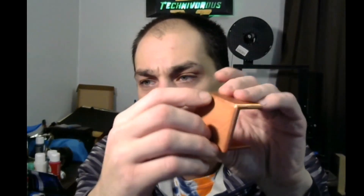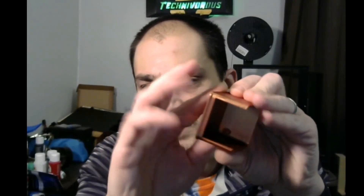Now that we've gone over that, I encourage you to play around with your own adhesion types. Depending on which model you're printing, you're going to want a different adhesion type. If I'm doing a sculpted model or a figurine, I will use a raft simply because it gives me a flatter base to print off of and I can tell if I'm going to get a good print before I get to the model part. If you're using something with a large flat surface, you'll want a brim to keep the corners from curling. And if you're just printing something small and not too worried about exact shape, feel free to go without adhesion.